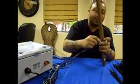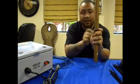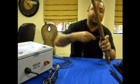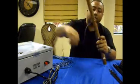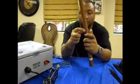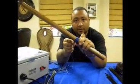Start off with wrapping your coil around the pipe, making sure it's laying up against the zip tie. Continue wrapping for 68 turns around the 1-inch copper pipe. As you can see, I'm keeping my coil closely wrapped on the pipe. Make sure there's no gaps or kinks or overlaps in your coil.